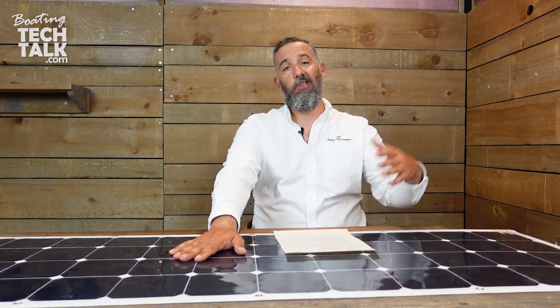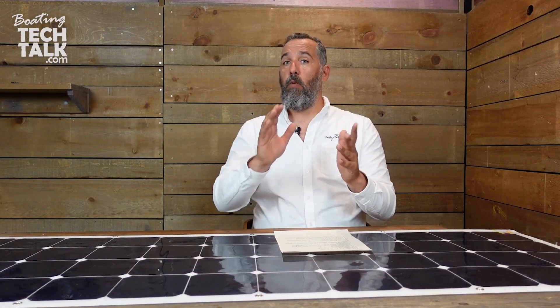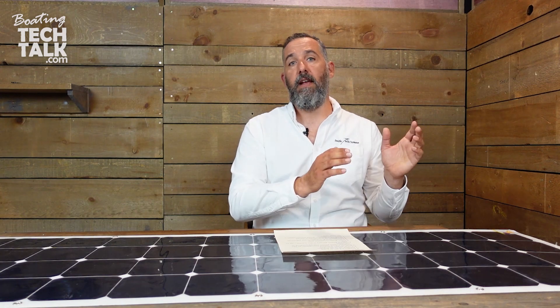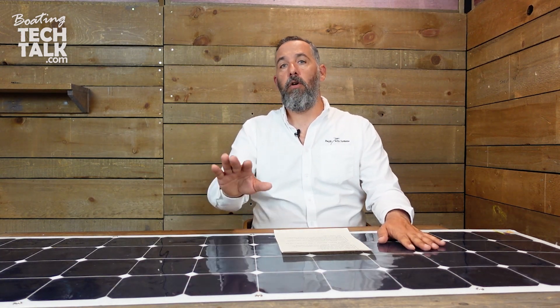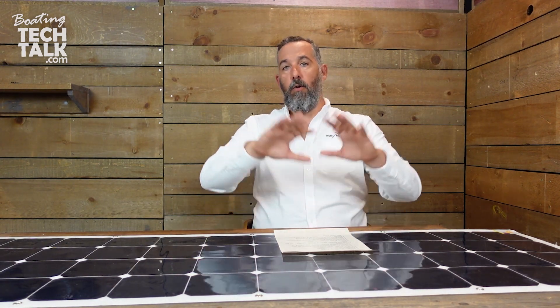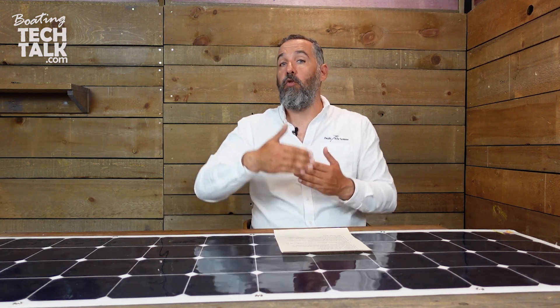When you connect the Solgo 160 to a solar controller, the rule of thumb always depends on where you are on earth. Around the equator, the days are on average the same. But as you go further north or south, like here around the 49th–50th parallel in British Columbia, Canada, the sun in June gives us maybe a 15–16 hour day of sunlight. In the winter, it's the very opposite — only eight or nine hours of sunlight, a lot of rain. But if you're cruising in the summer in northern latitudes, those longer days mean more output from your solar panels than locations with only 12 hours of sunlight. Here in the Pacific Northwest — and Europe is about the same latitude — the rule of thumb we use is a factor of four. So with a 160-watt solar panel, on average in the summer months, you're going to get about 40 amp hours of output.